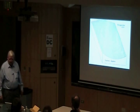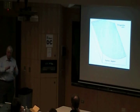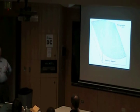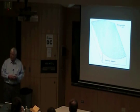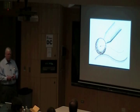And the first ones we made weren't quite that complicated. They were third order polynomial, and we did it with a lot of metal plates stacked up and a pantograph machine to take this big model and make a little lens of the same shape. And that was encouraging. I'm leaving out a lot of little midpoints along the way. But that's the shape we used, and we had to learn how to make them. But there was something else that happened that was kind of important that I'll come to too.